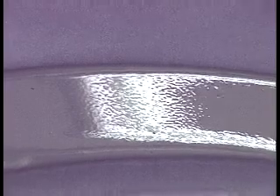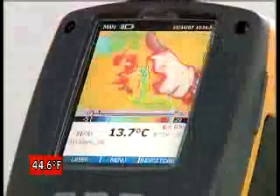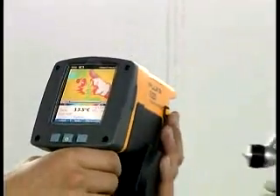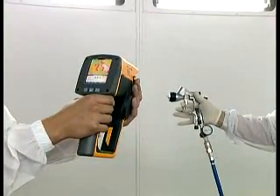An essential aspect is often ignored in painting: the compressed air temperature in the paint cabin. Paint is normally applied at an air temperature that drops from 14 degrees in the gun stock to 7 at nozzle output, due to expansion. This could be even lower in winter — certainly not the ideal temperature for correct new generation paint application.